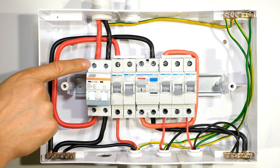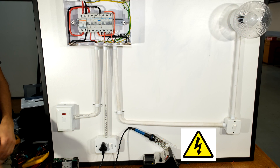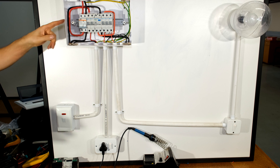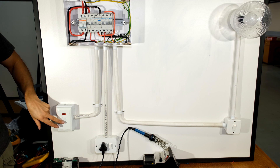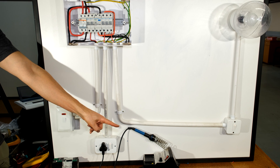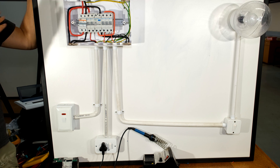Keep in mind that those two input terminals are still alive even when the main switch is down — only the output is no longer live. Now I'll show the load circuit energized. I've energized the supply — please note there is a serious shock hazard; your DB board should be closed. The main switch is currently down. My stove isolator is on, the plug outlet switch is on, my light circuit is on, but there is no illumination because the main switch is off.